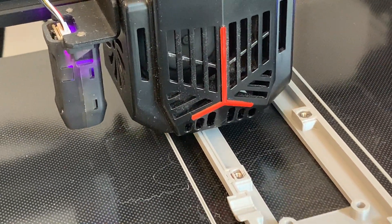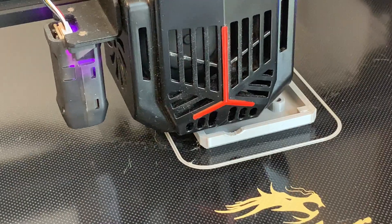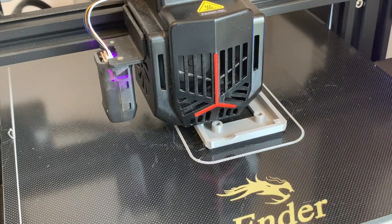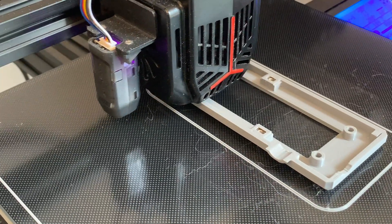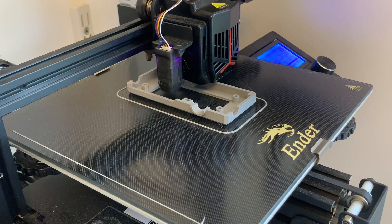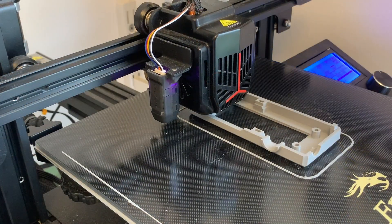The filament isn't actually on the nut — it's being printed over the hole. I've learned that a straight bridge is very much more effective, hence the square slot rather than a circular hole. We don't need to cover the nut entirely, just enough to give it something to push against when the bolt is tightened up, and all the layers above will give it strength. With the excitement of the nut insertion over, we can leave the printer to do its thing and go make a cup of tea.